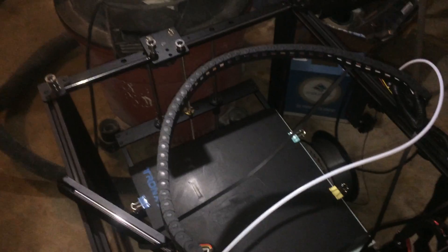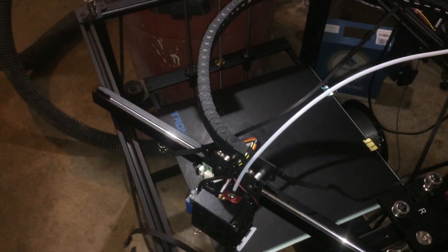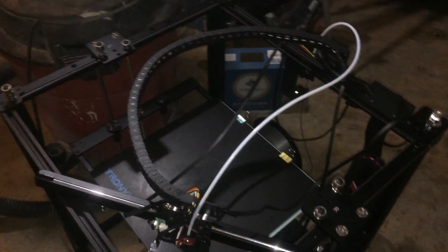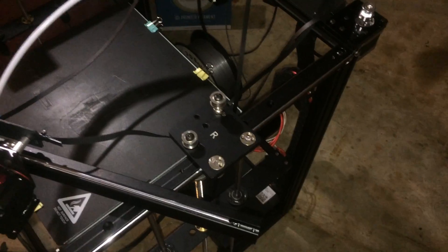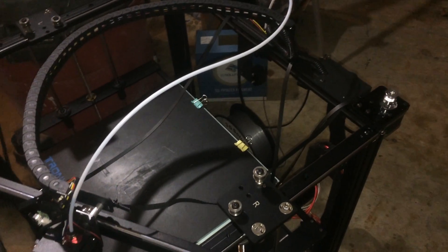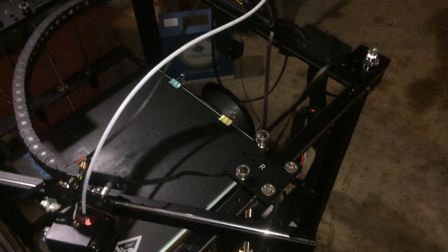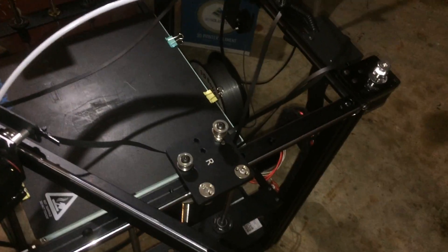Luckily I was sending a message to GearBest — the proxy store on GearBest — about what type of hot end could be put on here, and I asked the question again. Last time they assumed I had it in wrong because there's a right and a left rail, and they thought I mixed them up. But it wouldn't matter anyway because they're the same rail system. So I asked how to adjust it, and he came back saying it's not in the manual. They literally made a video for me on the spot on how to adjust this system, because with it being too tight the motors will move it but will eventually overheat and get damaged.